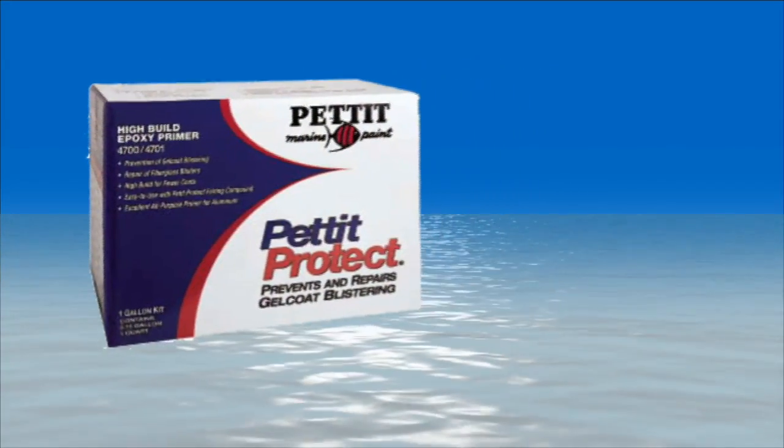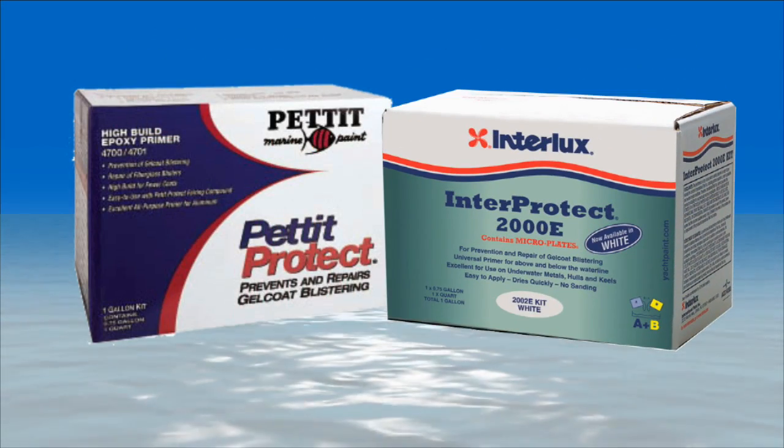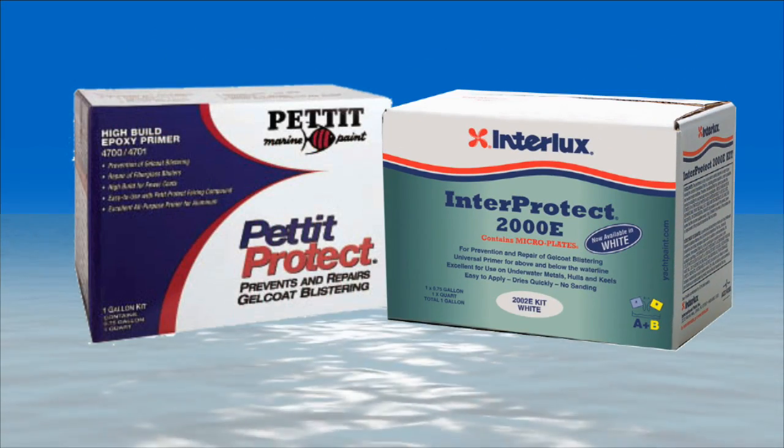By providing an impermeable layer of epoxy between the paint and the hull, water cannot be absorbed and therefore blisters do not form. Petit Protect 4700 and Interlux Interprotect 2000 are both great barrier coat products which are easy for the do-it-yourselfer to apply. If you plan on applying a barrier coat, you need to start with a clean hull.